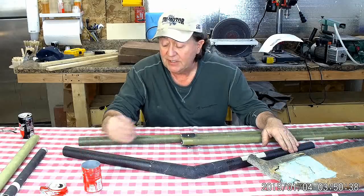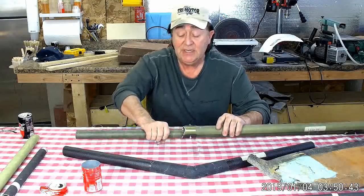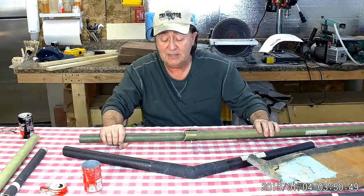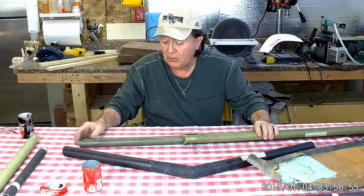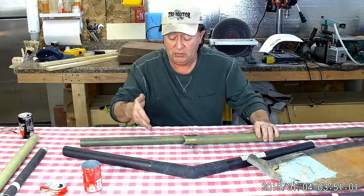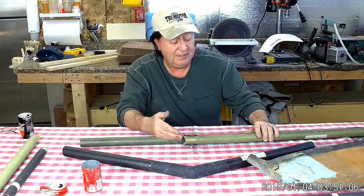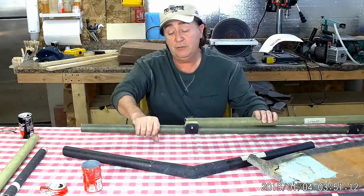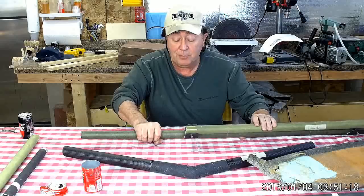That's the design constraint. If I went larger in diameter I can't take away a layer of skin because it's not going to have the crush resistance it needs, and it might not have the bending strength it needs either. So that's where we are. In some cases you just can't get around it - pilot's cage tubing, three layers thick, and it is what it is. Still very lightweight. A smaller diameter would probably be too small to get a good grip on.